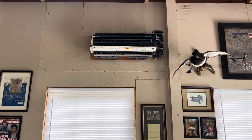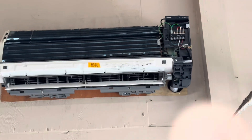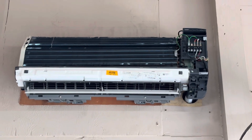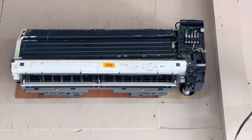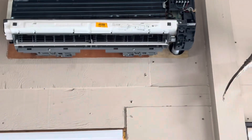We're just going to step back and take a look. For the most part everything is lined up properly. It does look like my side over here is a little higher — might have to put that down a little bit more. I don't think that will affect the operation or the way it goes back together, but you want everything lined up and back exactly how you took it apart. I did end up getting it locked in all the way. On those Daikin units, they have to line up perfectly — the metal of the coil has to lock into that plastic motor guard. If not, it will kind of pop up a little bit. It doesn't really affect the unit much, but it will make it look crooked. So you've got to get all that lined up right so it looks like it's supposed to.